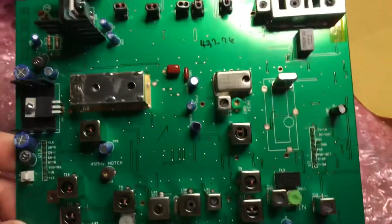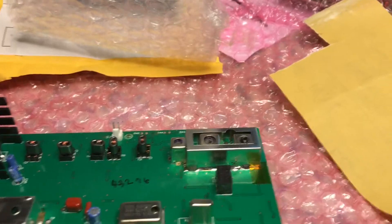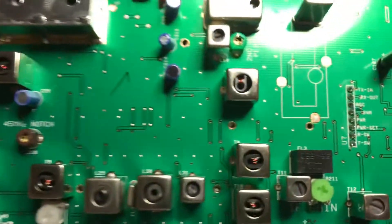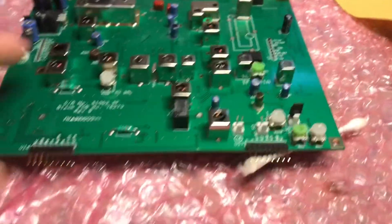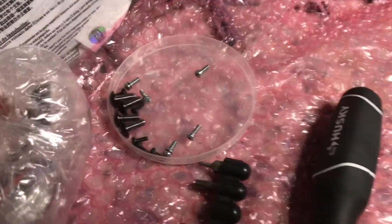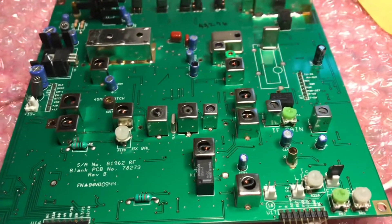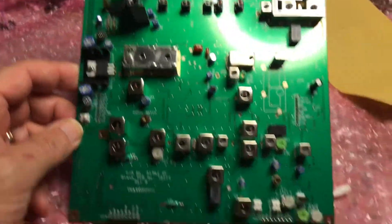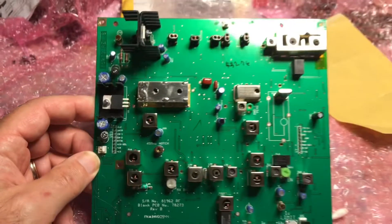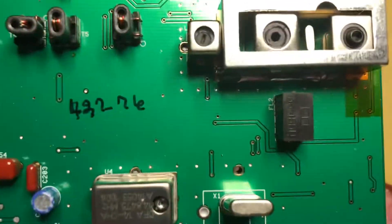What we're going to be doing is replacing the ceramic filters. There's FL2. We haven't had a problem with the receive, but we may replace FL3. It's very easy to uninstall this board — it's five screws, which you can see: one, two corner screws, three, four, and one in the center, right here. So if there's no output, you want to replace at least FL2.